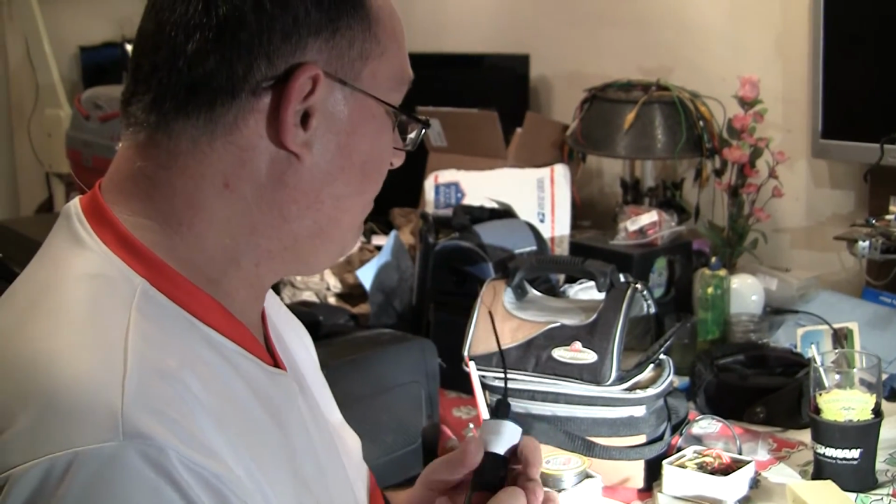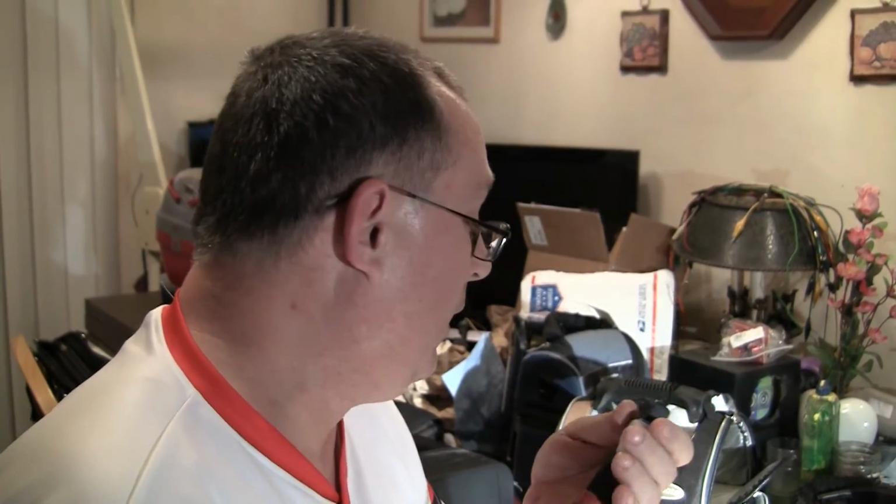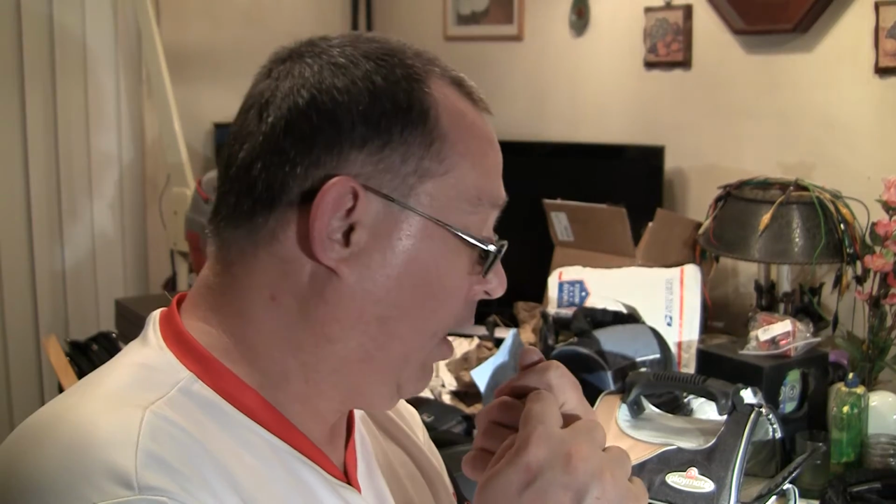This is just because people are curious about what I do, and if anyone is looking to do this on their own, hopefully this will be helpful. As far as the safety concerns, we want to use large enough gauge wire, especially coming in. We want to fuse it coming in from the hard 12, if that's what you're working with. And the first thing we do is find out the current draw of the device we want to power, because anything over 1.5 amps, these aren't going to work for. These put out 1.5 amps, and that's it.